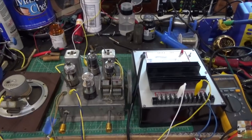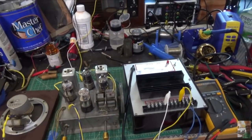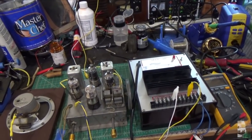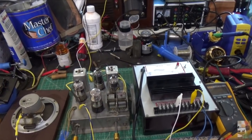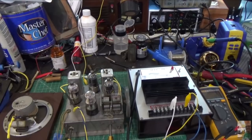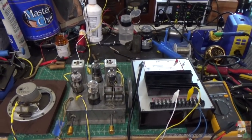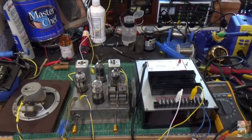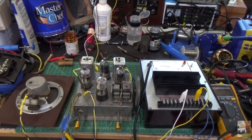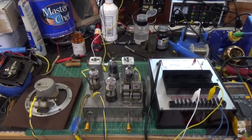One other thing before I wrap up: for the speaker and the antenna I'm going to use something called luminaire connectors — basically quick disconnects that go up to 600 volts. They allow you to quickly open up the case and get things out. I'll be adding those and you'll see them in the next episode. I'll probably add them to the power supply as well so there's no hard wiring, making it easy to take apart if you ever have to service it again. See you in the next episode, take care folks.